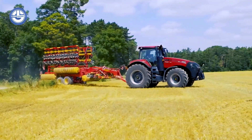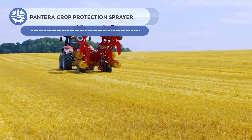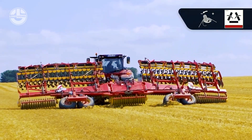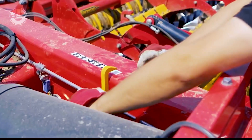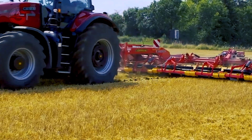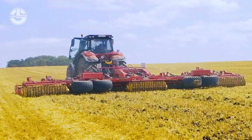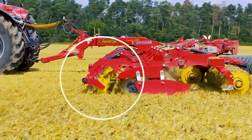The Carrier 925-1225 is a sturdy trail disc cultivator with a capacity of up to 16 hectares per hour and working widths of 9.25 and 12.25 meters. It can be equipped with true-cut discs measuring 450 or 470 millimeters, enabling intensive cultivation and deeper integration. The cross-cutter disc excels in oilseed rape stubble, cover crops, grain stubble, and plowed ground. The cross-cutter knife makes it possible to chop crop leftovers in two directions, enhancing germination and hastening decomposition of straw.